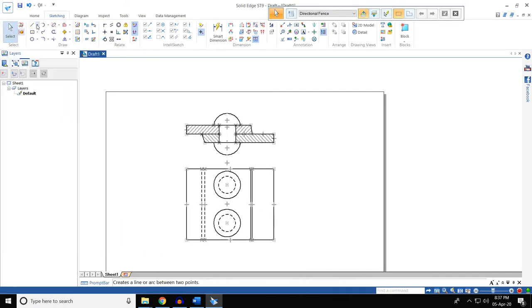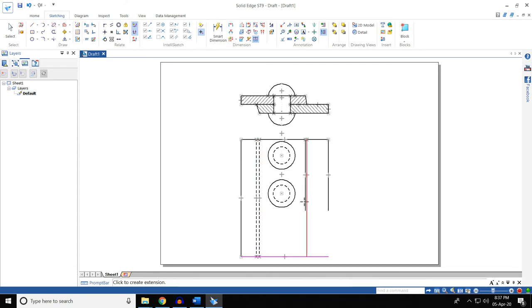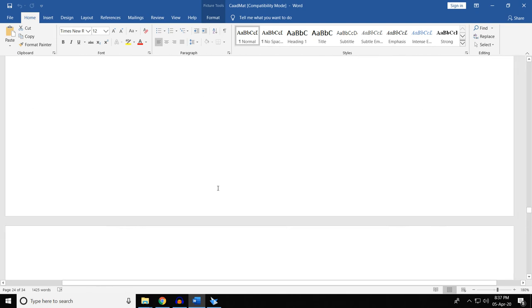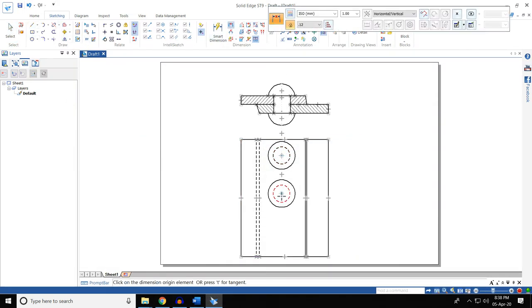Why not we extend this? Okay, we'll delete. Into next. Okay, and the distance between two successive rivets, that will be about what is that dimension given by? That is your pitch, obviously. So that will be about 3D, so 3 times of diameter. So this point to this point, 18 star 3, that is 54.